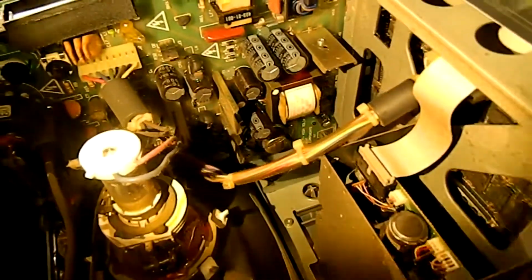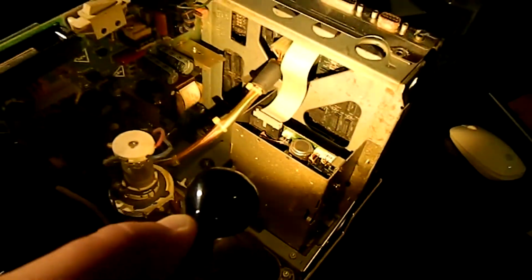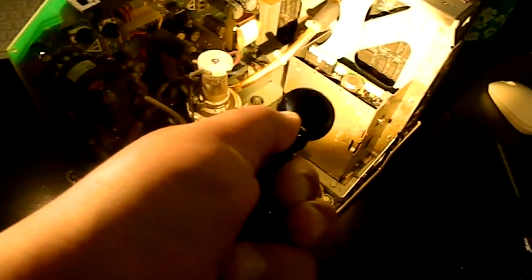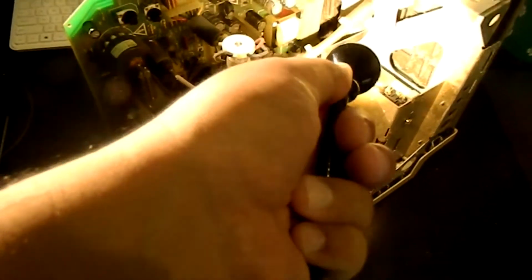Look a little closer in here. Grab a light as well. You can see that down in there we also have the loudspeaker. It had one mono built-in loudspeaker. You can see the volume control and contrast controls, I believe, also down there. And you can see that the logic board lives on the bottom of the computer and it's fairly heavily shielded. There are only 2 connectors that run to it. There's the floppy drive connector and the like multi-purpose connector that carries video and power supply from the power and deflection board down to the logic board.